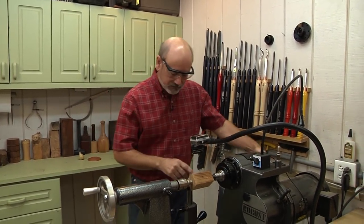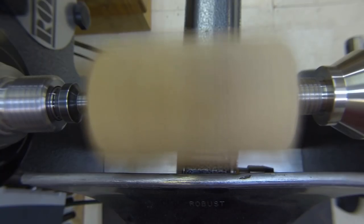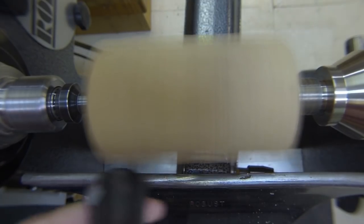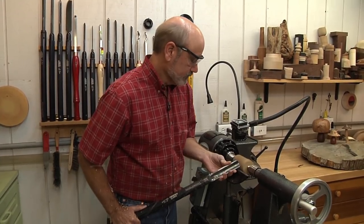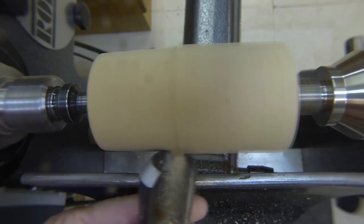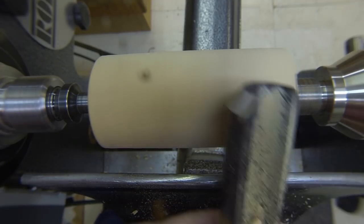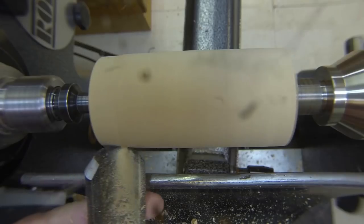Get my eyes on — nothing's hitting the lathe. I've got it mounted between centers. Going to turn this on and bring the speed up a bit. I'm going to grab my roughing gouge and we're going to rough this out — we're going to try to do this in real time because it doesn't take very long. Just moving my weight from left to right, using the tool rest as a guide. You can hear when you get into solid wood — no chattering.